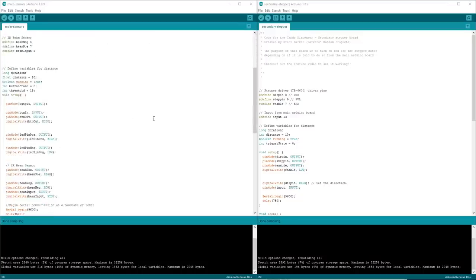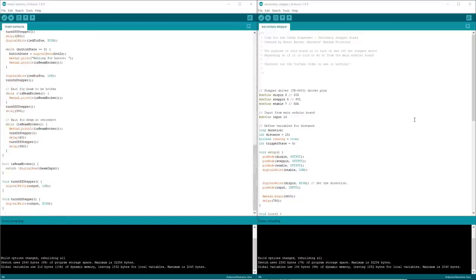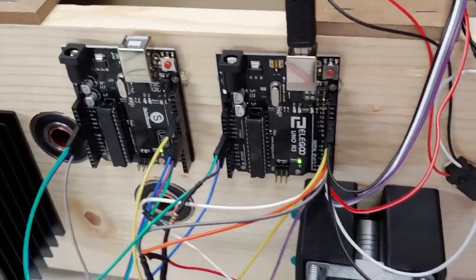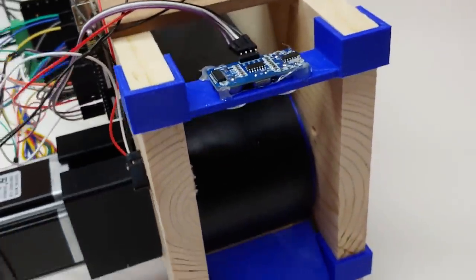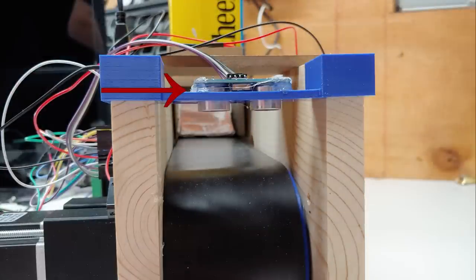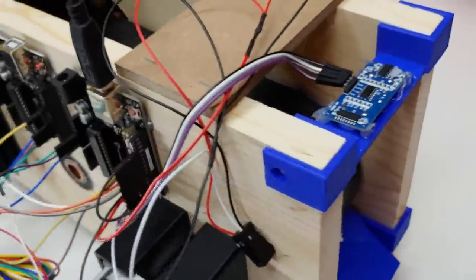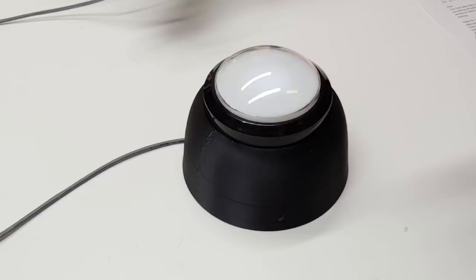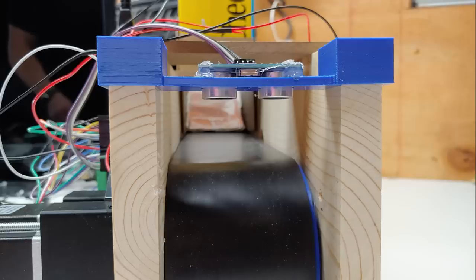For the Arduino boards, I went to work getting the programming down, which is available on GitHub, linked in the description below. As you can see, we have two Arduino Uno boards meshed together on the candy dispenser. We initially used a proximity sensor to determine if the candy was dropped. We realized that the process of reading the proximity sensor took a long time, which delayed telling the stepper motor when to stop. To get around this, we wired two Arduino boards together. One of them drove the stepper motor, and the other one worked on getting data for everything else, such as listening for the button to be pushed and reading the sensor. This solved the delay problem, but unfortunately we were not able to use the proximity sensor for other reasons.